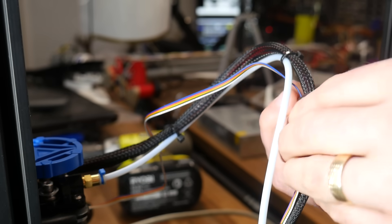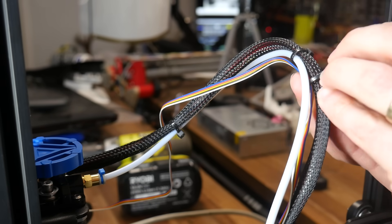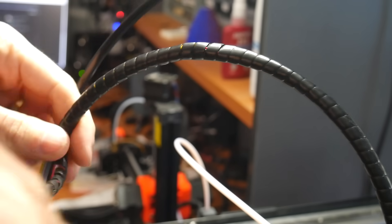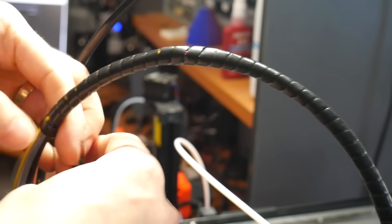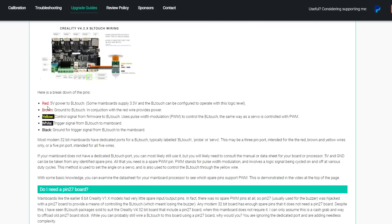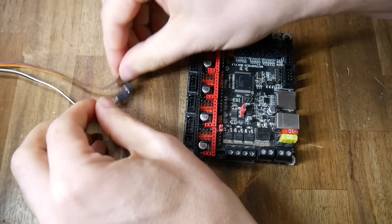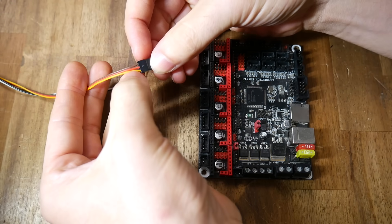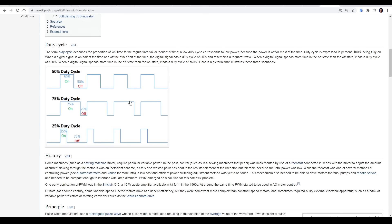You now need to run your extension wire from the BLtouch back down to the mainboard, and at minimum you should ensure it can't snag on anything by cable tying it to the existing loom. Ideally you'll use some sort of sleeving or cable wrap to completely contain it and keep it safe. At the other end we have the job of attaching our BLtouch wiring to our mainboard. On my website I have a breakdown of what each of the five pins does and an example of a wiring diagram. In summary: red, brown, and yellow are used to control the BLtouch, with red and brown being 5V and ground, and yellow being signal. This signal is pulse width modulation — switching a logic signal on and off — and the ratio of on to off is called a duty cycle. For a BLtouch, different duty cycles indicate different commands.